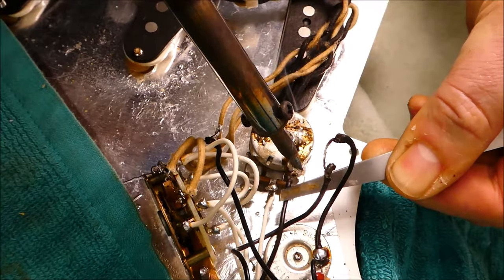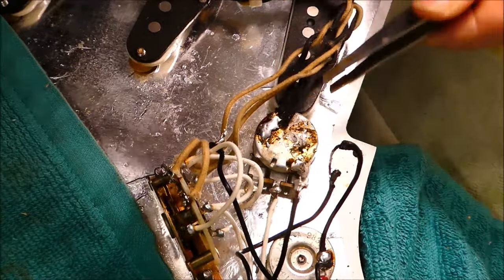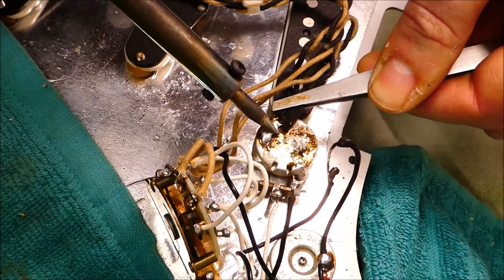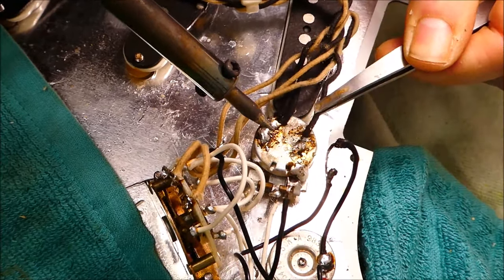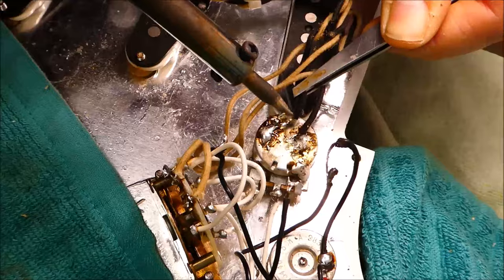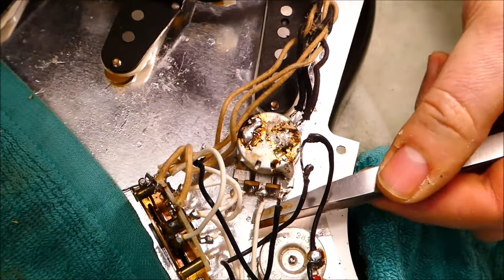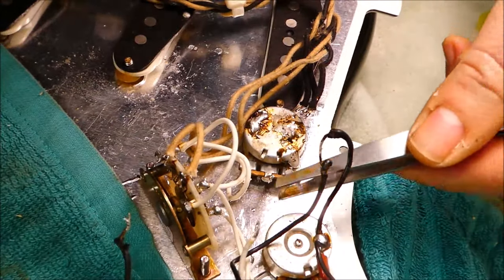So, I'm waiting for the replacement nut — the first one got lost in shipping — so while they send me another, I can get into what this job was really supposed to be all about. This volume pot has been subjected to a lot of solder and probably too much heat. If you leave the iron in contact for too long, it'll burn up the mechanism inside. You want enough heat to really flow the solder but not too much. For removal like this, I tend to like my big ugly 60-watt iron — it gets things flowing really quickly.